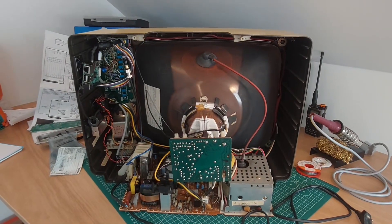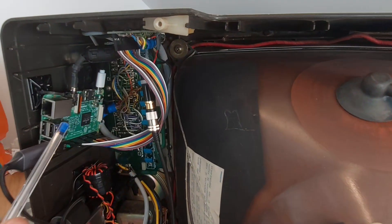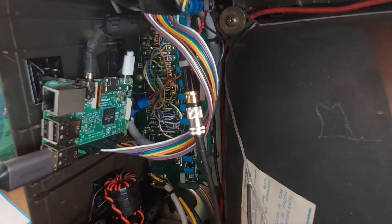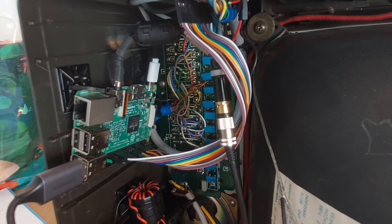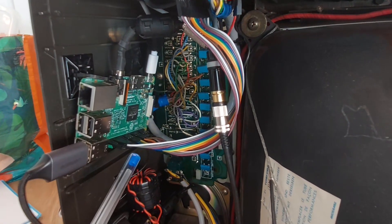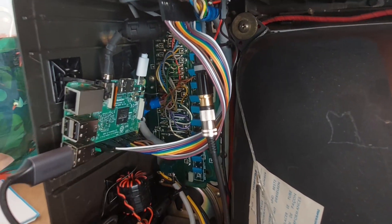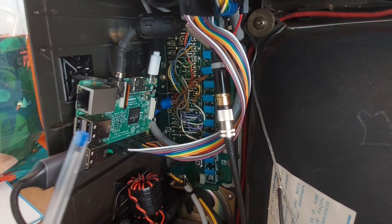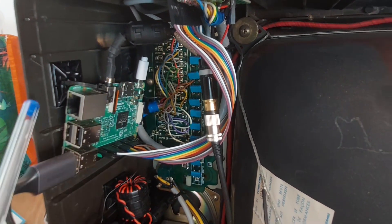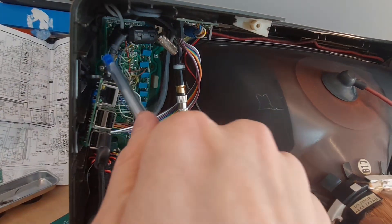Here's a look inside our television set. This is the IPTV decoder, and this is just a Raspberry Pi 3 — a low-cost, low-power Linux computer. In this case it is connecting to a Wi-Fi network. It gets an IPTV stream, then decodes it, and then converts it into an analog audio and an analog video signal.